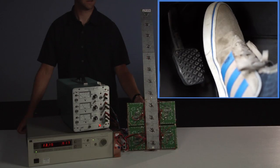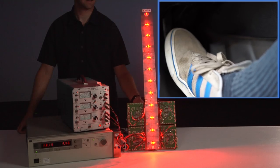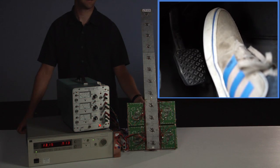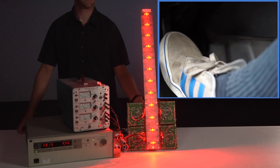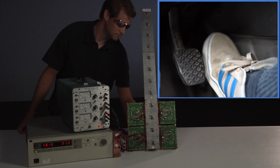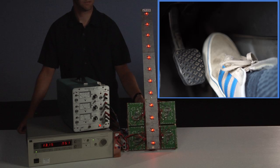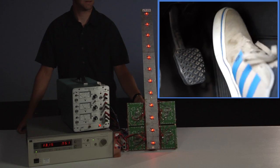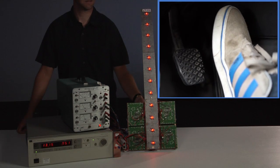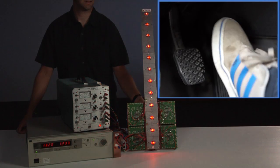When many independent LEDs or strings of LEDs are needed, multiple LT3797s can be used together. Here, four LT3797s are used as triple buck-mode converters to give us 12 channels with independent dimming and brightness. This exciting, high-power brake light detects brake pedal position and gives drivers more information than the average brake light with its moving light output.